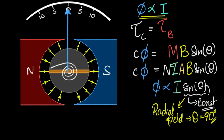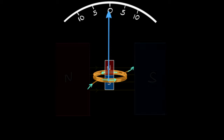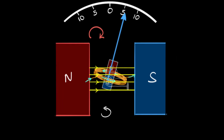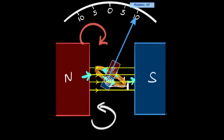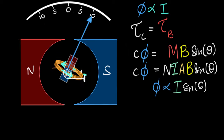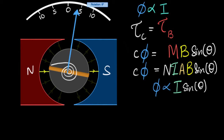To summarize: when current flows through a coil, it behaves like a magnet; in an external magnetic field it experiences a torque that twists the coil. Coil springs produce a counter-torque, and when the two torques balance, the needle reaches equilibrium — giving more deflection for more current. To make it linear, concave pole pieces and a cylindrical soft iron core produce a radial field, ensuring the angle between the field and pointer always remains 90 degrees, so deflection is proportional to current — a linear galvanometer.